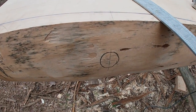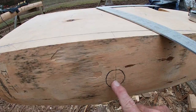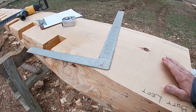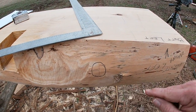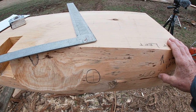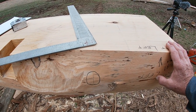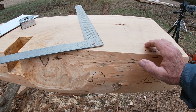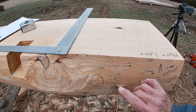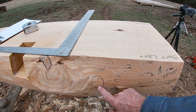I have the mark here that I need to drill on the bottom side of the log, and on the top side of the log I made that same mark. I'll actually drill from the bottom through the top — I won't drill all the way through because my bit's not long enough, but I'll try to connect those two holes in the center with my drill bit. Then the log can slide down over the rod, which will slide up through, and I'll put a washer and a nut to bolt it to the pier.